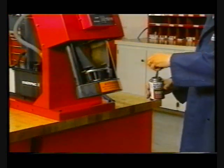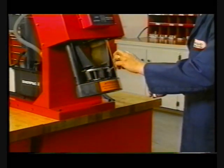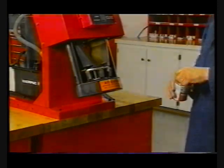For maximum service life, the ProCrimp 1380's die cages require lubrication with never-seize at 50 crimp intervals. Also, the die cages and crimp ring should be periodically cleaned of old never-seize and re-lubricated.